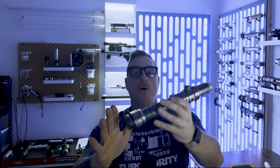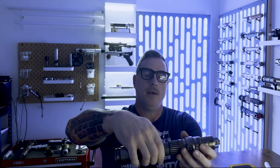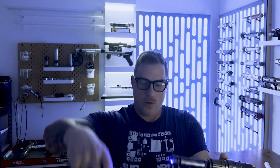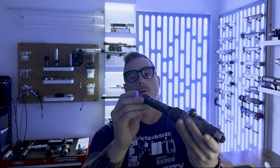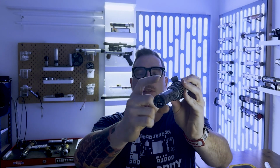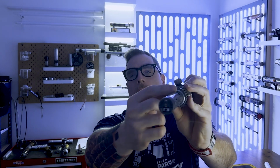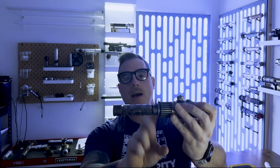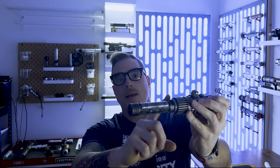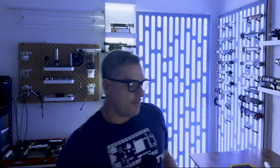So with tight builds like this, I do like doing that tilted Proffie board because you can still really easily get to your USB. Let's turn that off so I'm not blinding you. So you can get at the USB port and your SD card because it's just peeking right underneath these threads, and you save a lot of space. I mean, I've got 1.5 inches of space that I save because I'm hiding that Proffie board up underneath the upper part of the hilt, right?